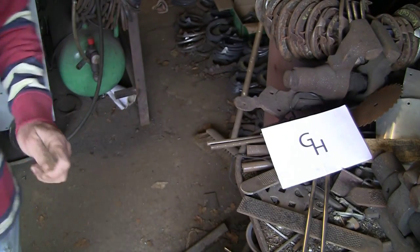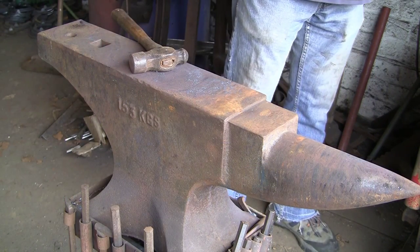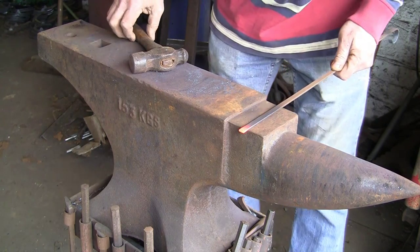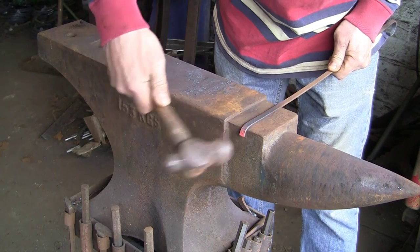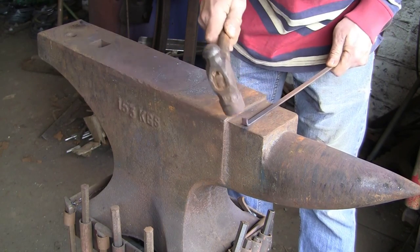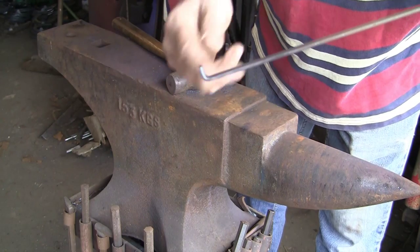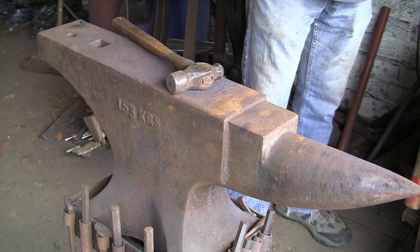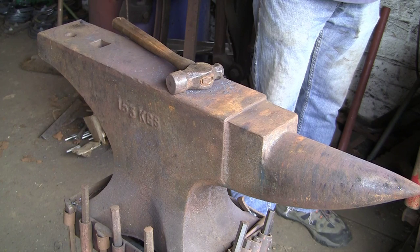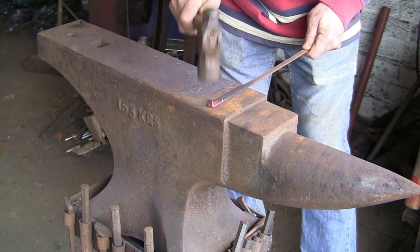So next we want to do the hockey stick. I am going to do that on the other end. I want the sharp bit of the anvil here. My anvil hasn't really got many sharp edges, so I am going to use the cutting table - that is about the sharpest bit we have got. I am just going to bend over about three eighths of an inch. Pull it back, bend it over, but don't hit the corner because you want to keep some meat in it. I am going to try and heat it up and bash it back into itself.